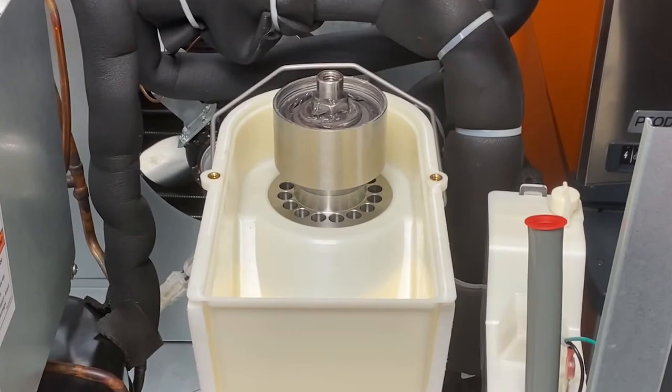At this point, the condition of the grease can be evaluated. Normal wear on the bearing will cause the grease to become gray over time, which is an indicator that the bearing needs to be re-greased. If the grease is extremely dark, watery, rusty, or has any visible metal flakes, the bearing should be replaced.